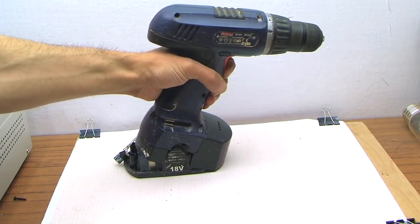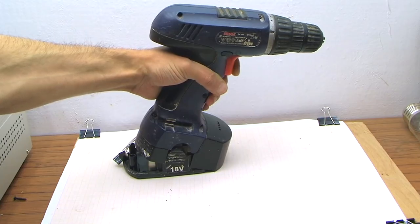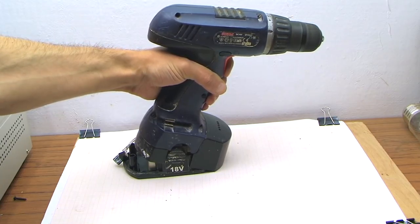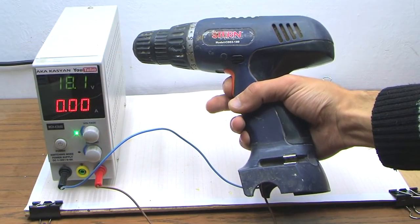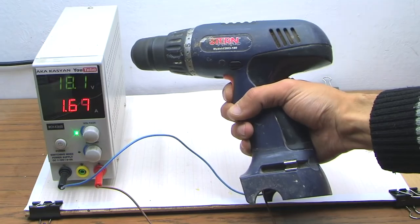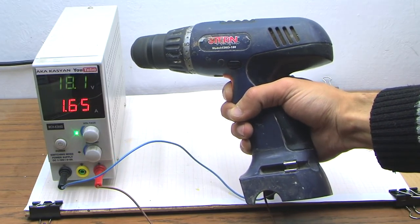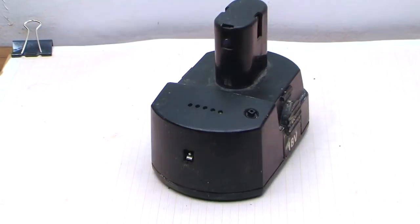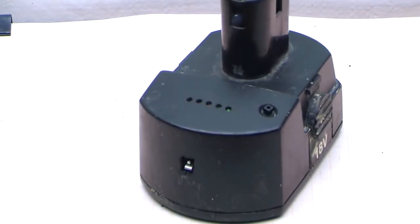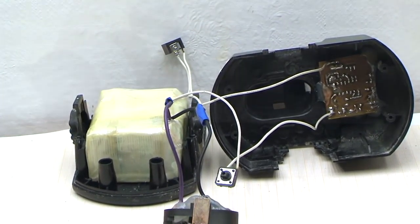Now let's connect the battery for preliminary checking. Just now it became clear that the button of the screwdriver is broken, but at first I thought that the problem was in the reduced supply voltage and fed 18 volts from the laboratory power source. The problem was the same, so I will fix the button later. Then I took a convenient power socket through which the battery will be charged. How to charge the battery and how to assemble the charger as a whole, we will talk about in the next video. It will be released within 10 days.